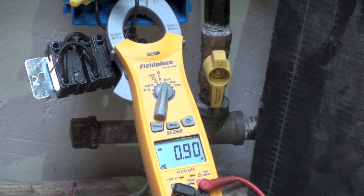The standard meters read about half what the true RMS meter reads. The conclusion: if you're trying to do amp draw readings on parts that have electronics in them — even checking the AC current coming in, not the DC going to the light — it will read differently. So many things today are electronics: ECM motors are all electronic. You can't check them with older meters; they just won't read accurately. That's the comparison of amp draw with a true RMS meter on an electronic circuit versus older non-RMS meters.